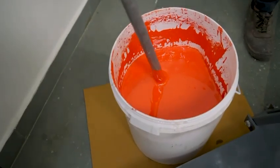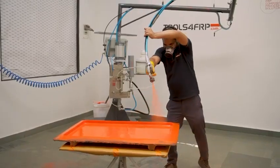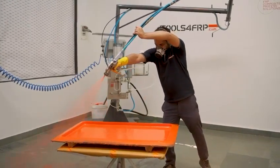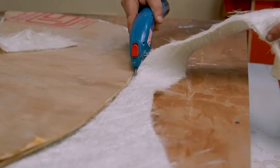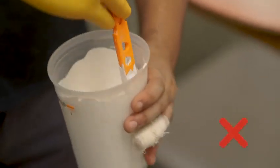Pre-pigmented and pre-accelerated gel coat will give better results. Your gel coat is complete in less than one-fourth the time in comparison to brush application. Once it is tacky dry, we can straight away start. There is no need to cut fiberglass mat or prepare resin, or need of measuring and mixing catalyst in a molder's bucket.